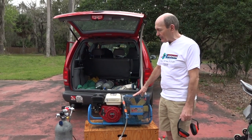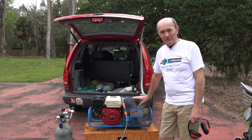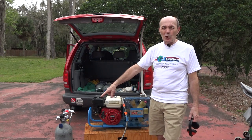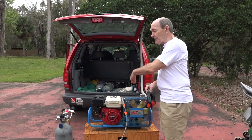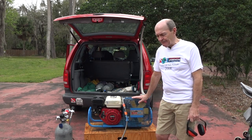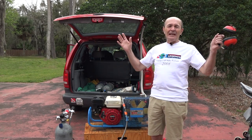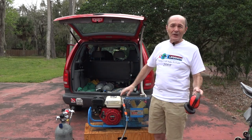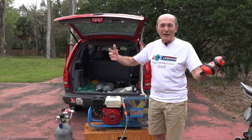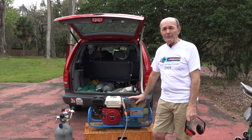I've sold dozens of these to small groups or individual divers. The '35' in Max Air 35 means approximately 3.5 cubic feet per minute — you may or may not get exactly that. For a standard 80 cubic foot tank, it'll take the better part of half an hour to fill. But it's portable — you're at the dive site, you have a couple of good dives, you sit down for a sandwich, start the compressor, fill one tank in 30 minutes, fill another in 30 minutes, and you're ready to dive again. You don't have to own extra tanks or run to the dive store.